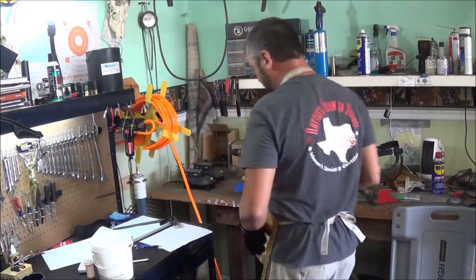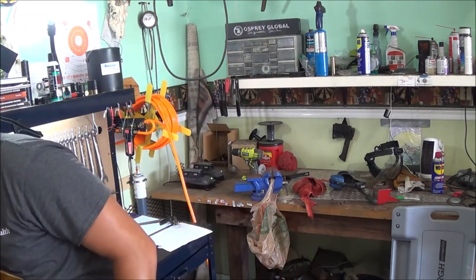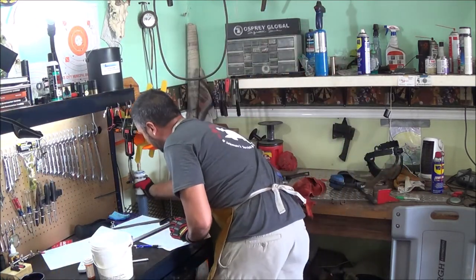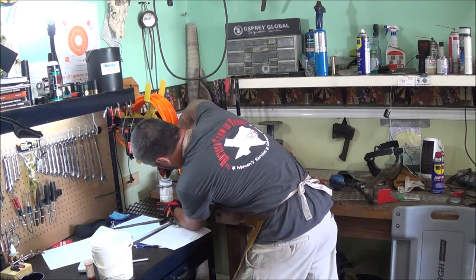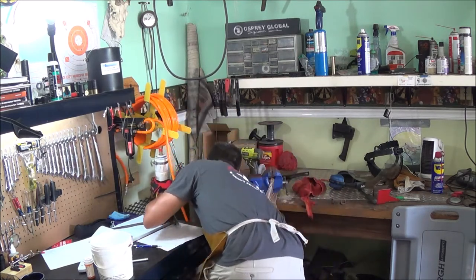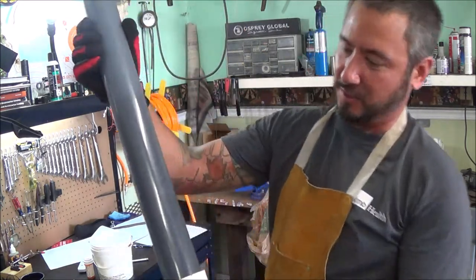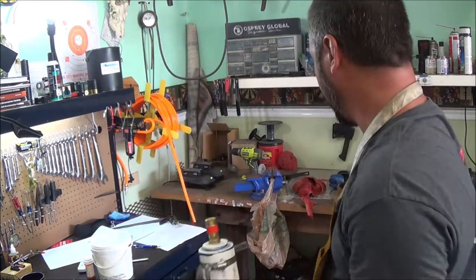All right, so first thing we're gonna do is obviously make sure the air pressure is released. So we're gonna go ahead and do that. Oh, and I just dumped water all over the floor, but no air pressure in it. And I made a little hanger for this guy, so it's easy to pop off. And just like that, the tube comes out. So now I can just unscrew this, which I'll clamp it in the vise.